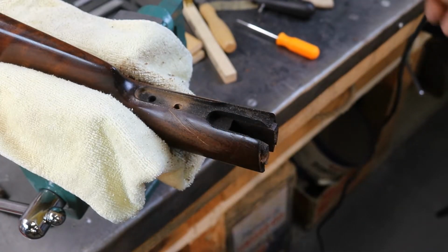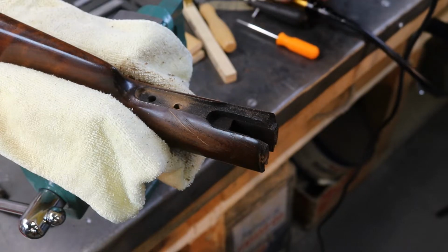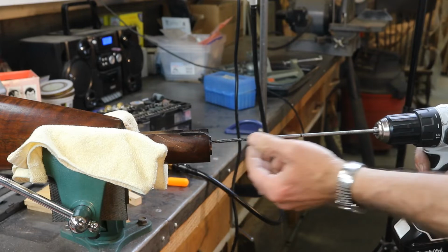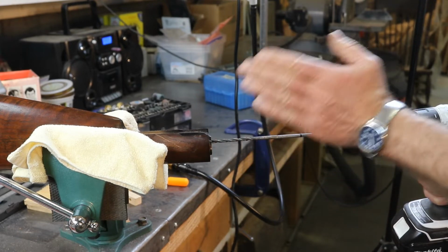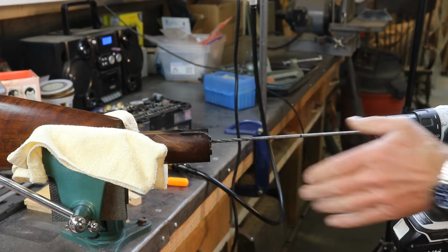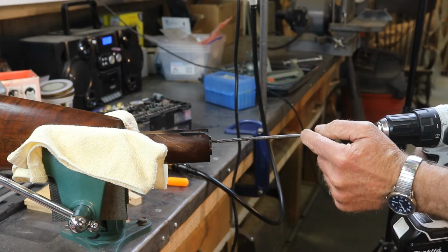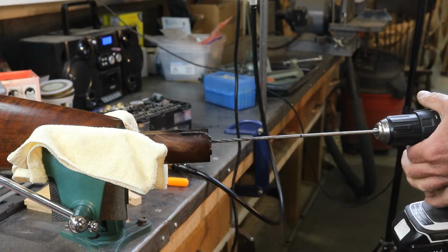now we need to switch to our cordless drill for this other one. Now the challenge with this one, with this big long bit, is keeping everything straight and level all the way through, and we're going to take it nice and slow. You see we've got a long way to go. Our mark's clear back here.